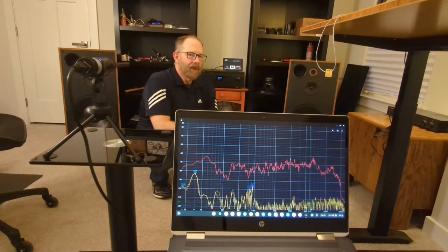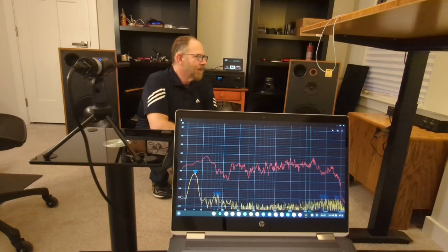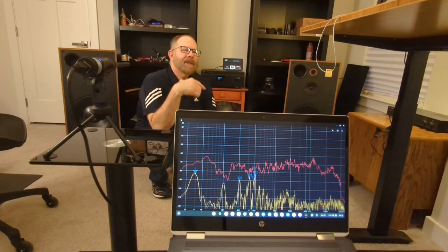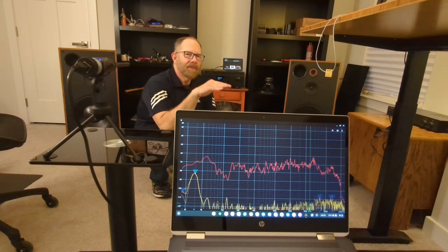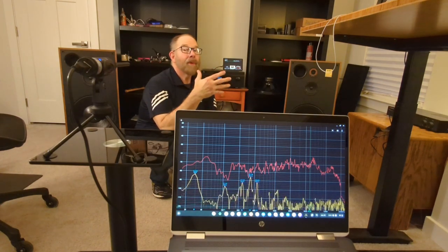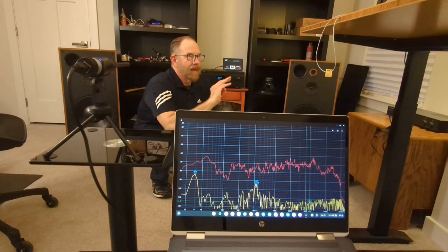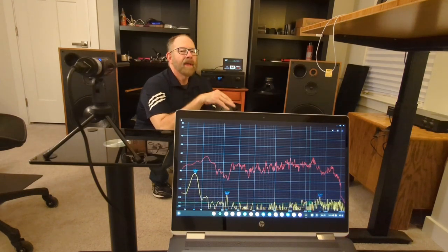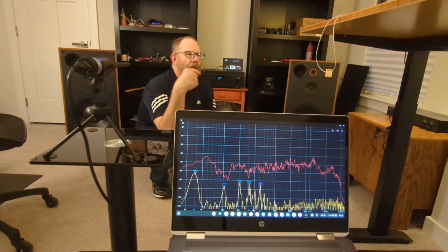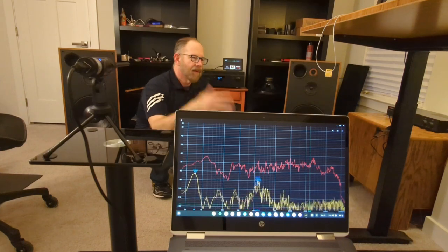Just changing it like I did, 3 feet away, and this is in the equilateral music listening angulation that is recommended, but that's what you see. So anyway, going back to what I was doing before, I want to measure each speaker individually, see how it measures out, see how that top end is, make sure it's straightened out. Honestly, I don't really care that it's a little bit lower on the top end. I don't necessarily need it super bright. After 10,000 hertz, it's literally downhill for me as far as my hearing. When it gets near 13,000, I can't hear it at all. If you can hear it, let me know, but I can't. So I'll go ahead and set this up to measure that speaker and then the other speaker. I'm going to do it smack dab in the middle of the room, kind of close up, and let's see how it goes.